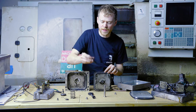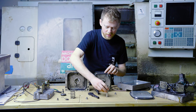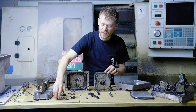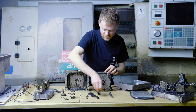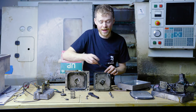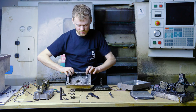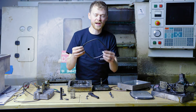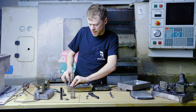There's actually an older style and a newer style. This is the part you can get at CNC replacement parts. The oldest one does not have a left-hand thread bolt. The newer one does, and the newer one may or may not have a hex, but it's reverse compatible — the newer one will work in the older one. Let's act like I'm going to clean this and put it back together. You see how the O-ring kind of has this shape — it will easily go back together and shouldn't be too hard.